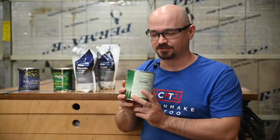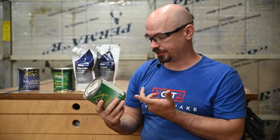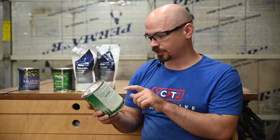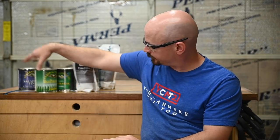So yeah, almost any finish you have that's unpigmented for wood, when it's cured, not dry, but when it's cured, which is very different, and you can find the cure time, like all kinds of other fantastic information, probably right there on the back of the can. This will tell you how you can recoat it within a couple hours, but that it cures in like 30 days. That's pretty normal, 3 to 4 weeks. And if your container doesn't say, then give it 30 days. Almost everything cures in 30 days and you're safe.